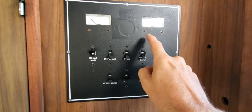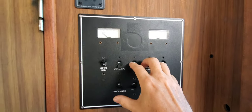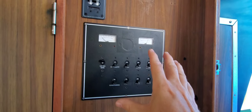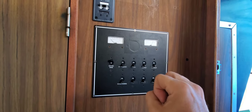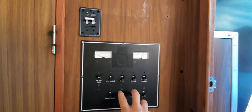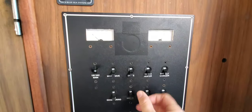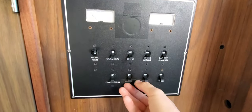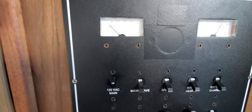I don't have a microwave, hot water heater, or air conditioning, but if you did you could hook it all up here as well. I got this pre-wired panel off of Flounder Pounder many moons ago — a great buy that saved a lot of work. To charge the batteries, I have two breakers hooked up to GFCI outlets in the bilge; the chargers are already plugged in, so I just flip these breakers on.